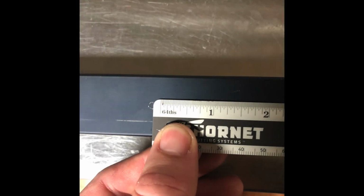Once you've determined this position and the assembly is in place, tighten the outermost set screw on the other side. The set screws will create a small circular mark that you can use to create your cut line. It's only necessary to make one cut using this method. Measure 1/2 inch past the circular mark you made, and with a square, mark and cut your spacer bar.